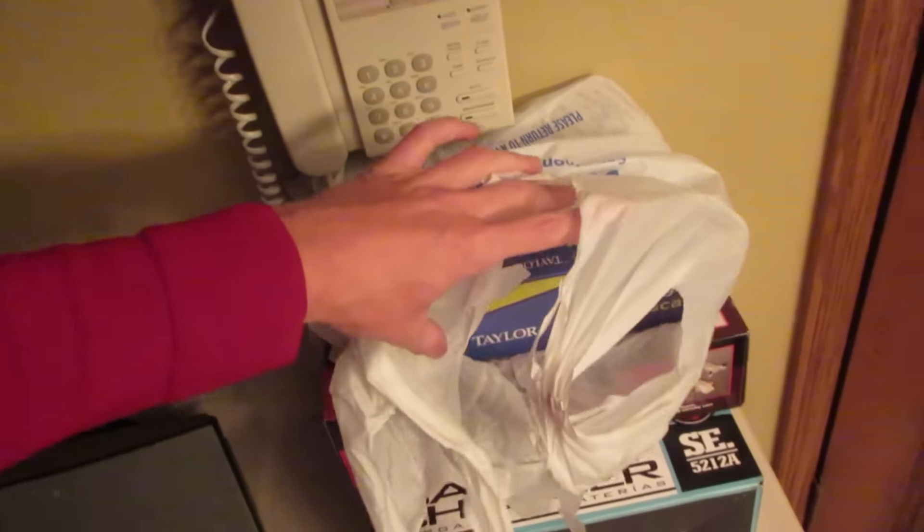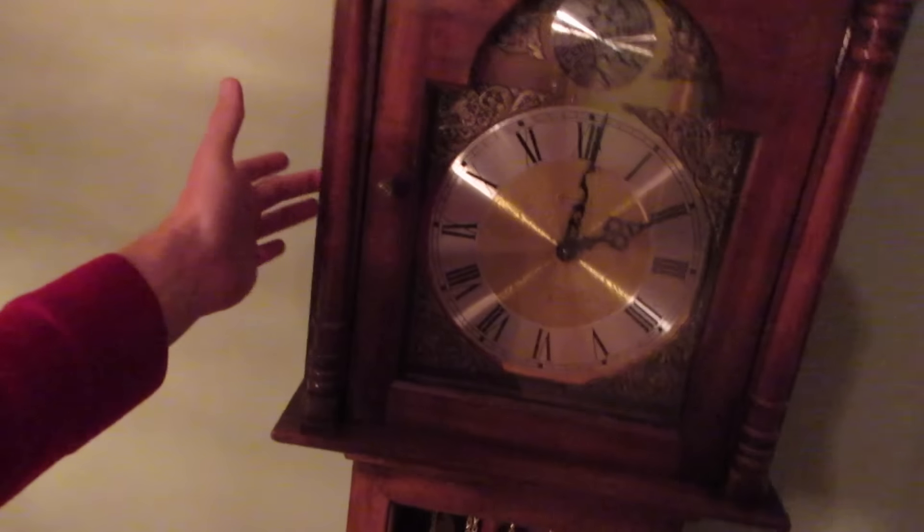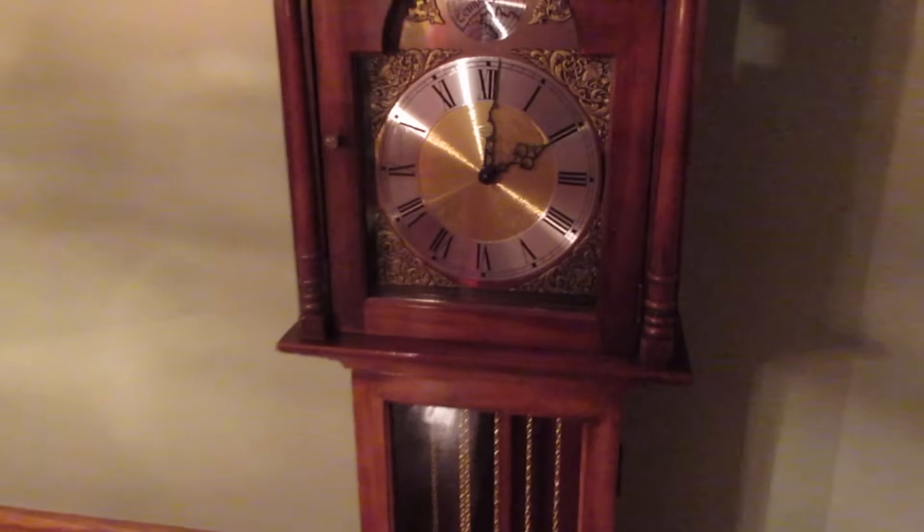Good morning — it's two o'clock. I actually spent some time on the clock today. I headed over to Walmart and bought a cheap food scale that measures grams fairly accurately, because the weights were totally screwed up. We need 6.6 pounds on the right for the Westminster chimes, 4.7 pounds in the middle for the pendulum, and 4.7 pounds on the left for the hour gongs. I had to adjust all of that, moving lead beads between the weight canisters, and got everything adjusted right. But it's still running through the hour gongs too quickly compared to the Westminster chimes — I've done everything I can, so I'll just let it go and have the guy look at it during general maintenance in a couple of years.